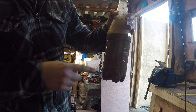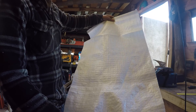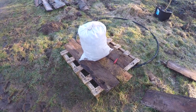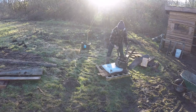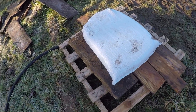We'll leave that to settle out and get a good indication of what layers of material we've got. Remember when we did the roundhouse series, I used these bags as a foundation filled with grit and stone - we're going to fill one of these up, tamp it down, and let it dry in the sun, then open it up and see what sort of properties it's got. I've got a pallet down to keep it off the ground. Tamp that down now, making a solid block.